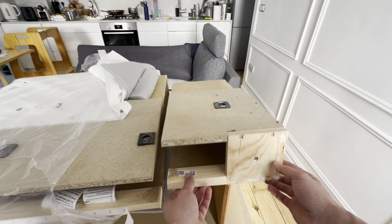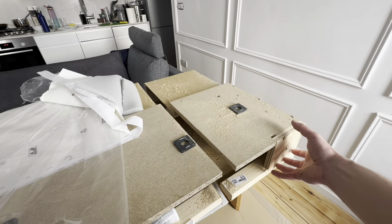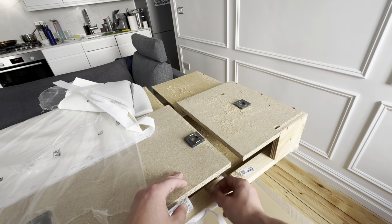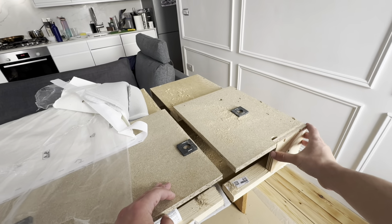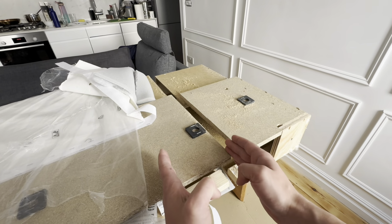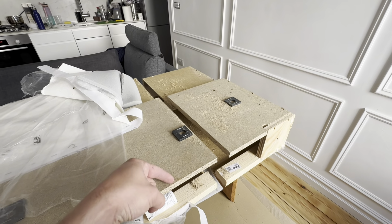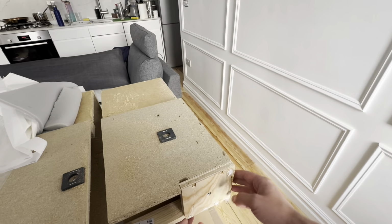As the beady and eagle-eyed among you will have noticed, if you have something similar, this is actually set into the panels, the side and bottom panels, and the rail as professionals would call it. What that means is that once we've taken this out, we can take that and place it on top of here to take the measurements, and on this part as well, place that there and mark how deep it goes, and then we'll have to cut out a little notch in either one where this will sit.